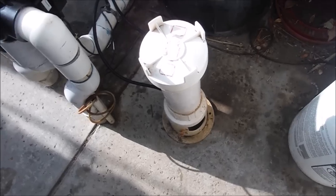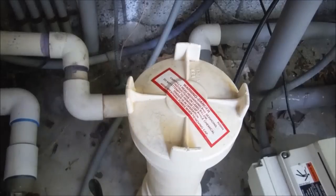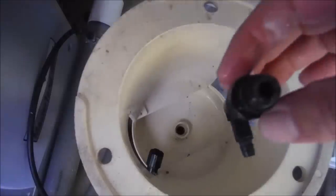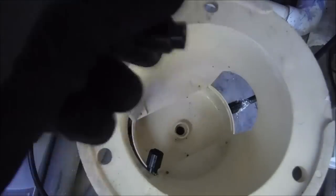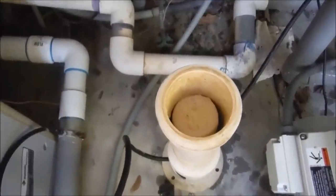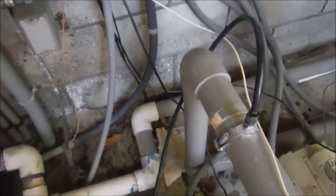Those check valve elbows wear out all the time — I carry a bunch of them in my trucks and I'm replacing them all the time. The tablets have not been dissolving in here; it's pretty toxic. The paste from the chlorine tablets gets in there, and there's a little ball bearing that's supposed to stop the flow when the pool turns off, so the paste clogs it up. If you're installing a FlowViz in a Jandy check valve near one of these chlorinators, make sure it's working efficiently — otherwise the toxic level of acid and chlorine could go back into the pipes and damage the FlowViz unit.